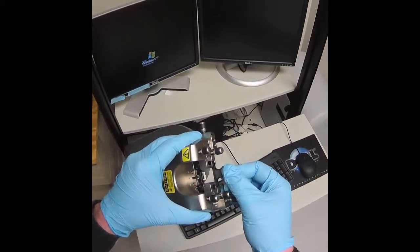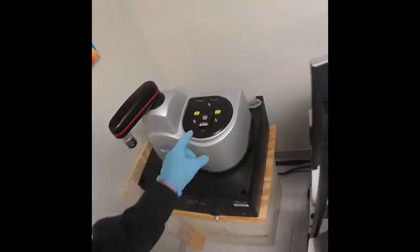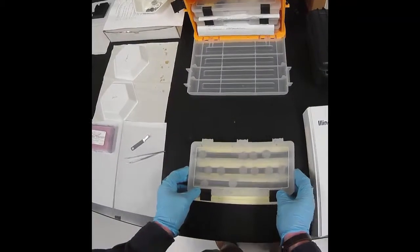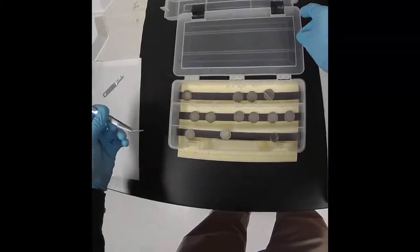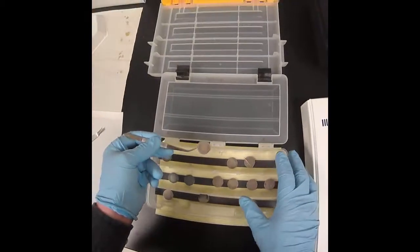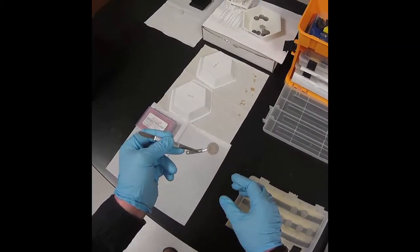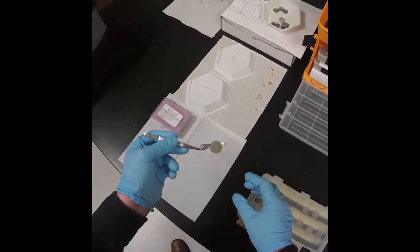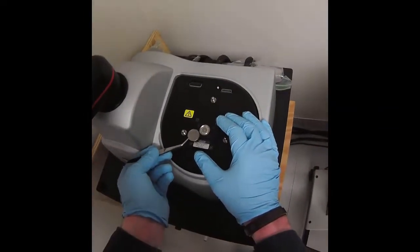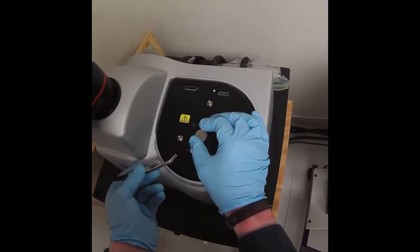The cartridge snaps into the scanner head. Before we put the scanner head back in place, we need to put our sample into the sample holder. So we select our sample, recalling where we wrote it down in our index. These are steel discs, so they sit on that refrigerator magnet strip. The instructions tell you how to prepare the sample onto the surface, but we put a glass cover slip onto the steel to provide a smoother surface. I usually slide the sample onto the holder because there's a magnet there — I don't want it to snap too much and maybe knock off my sample. So center it on the holder.